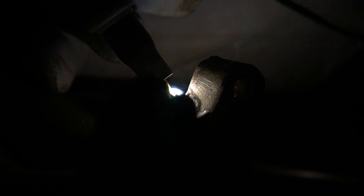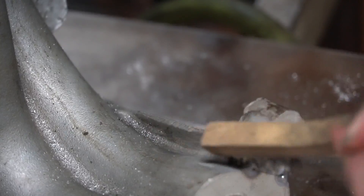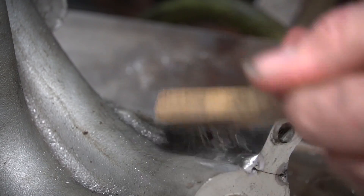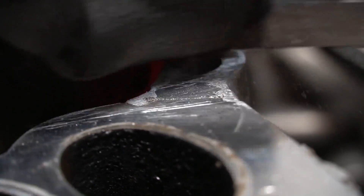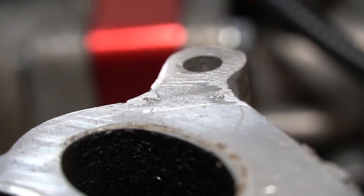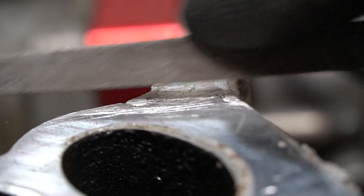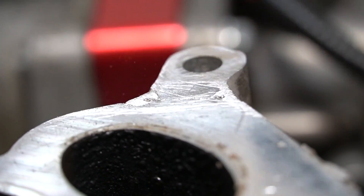None of this really looks all that pretty, and that's the thing — cast is a fickle metal. You don't always expect it's going to come out perfect, but all we really want is some solid foundation for that new metal to stick to. Don't expect them to come out looking like dimes all the time because that's just not realistic. What you're working with is going to produce the right results — sometimes you get lucky, sometimes not. I'm going to file away on some of this bead here around the edge, just so I can get a nice clear shot of creating a groove with the file.